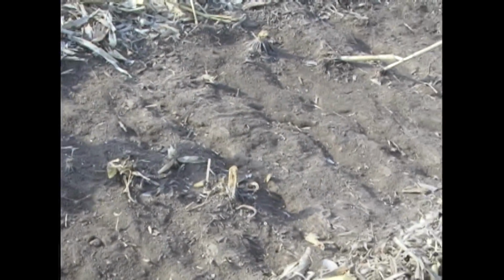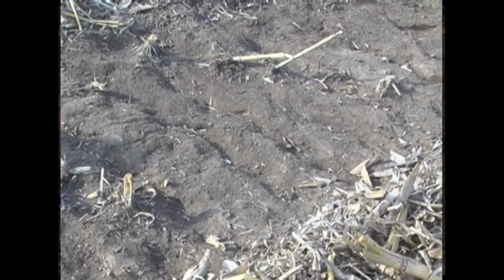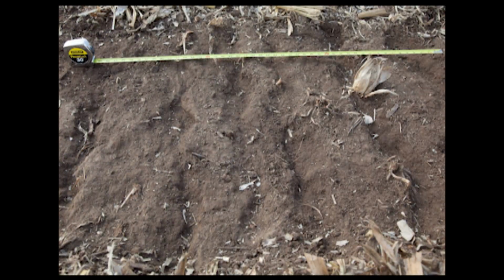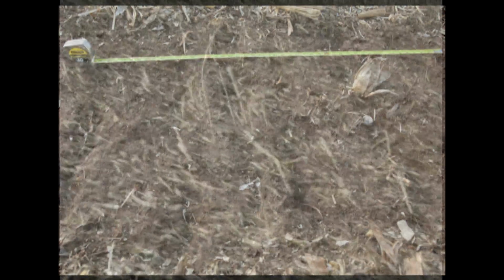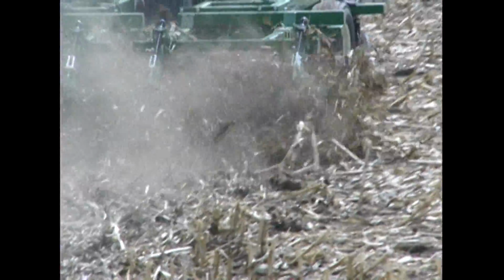A third tool utilizes all coulters, but the wide spacing and leveler system prevent the tool from taking out the ridges between the coulters, and again the spring-loaded shanks result in wide variation in tilling depth. The same harrow and reel combination is used, and again, it's not aggressive enough to level the planting surface. So how did the TurboTill and TurboChopper do?